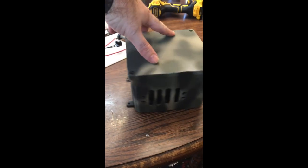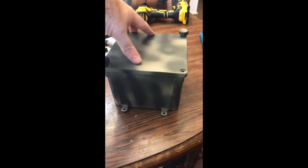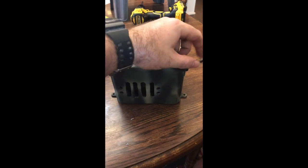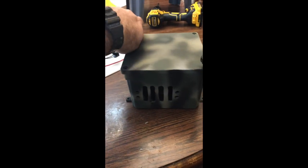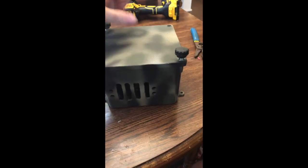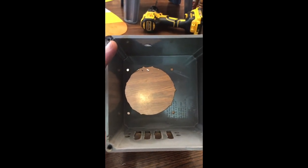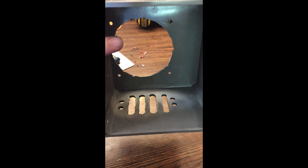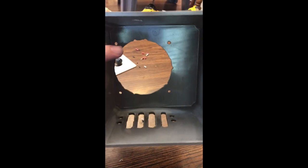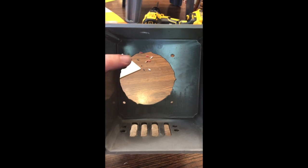Here's the box. This is a 6x6 PVC box — a junction box. Get it from Home Depot or Lowe's in the electrical section. What I did was add some knobs, maybe quarter-inch 20 thread pitch, and just threaded them into the top section. So you've got your top — you're using two of the knockout holes. I've got the hole drilled for the fan, holes for the fan, and that's the hole for the switch. That's where all the ozone that'll kill the scent will come out. We'll show you how to lay it out in this box in just a minute. We're gonna install the fan first, then the fan guard, and then just start laying things in there.